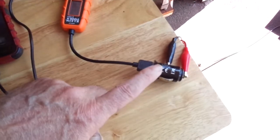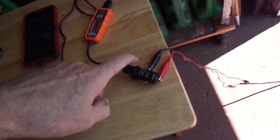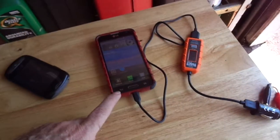It's just a generic solar panel — no special brand or anything. Non-sale price is around $21.95, and if you look around various sites you can probably get it for under 20 bucks. You also need a cigarette plug adapter and a couple of clips. Make sure you follow the color code — red to red, black to black; red is positive, black is negative — same thing on the plug.